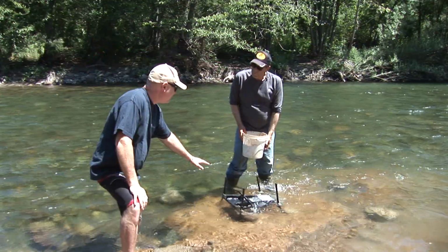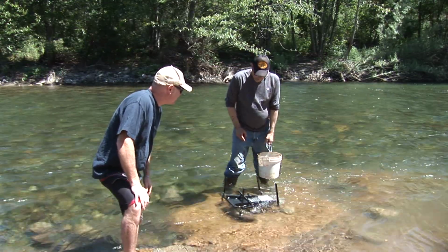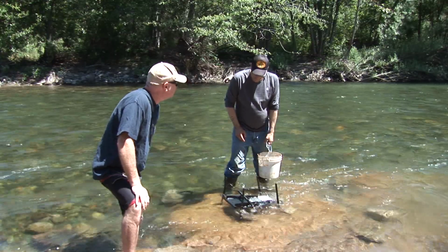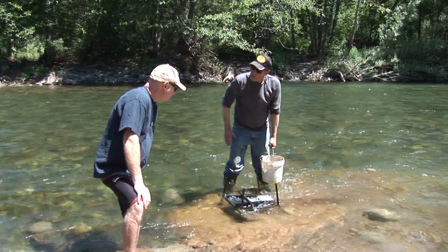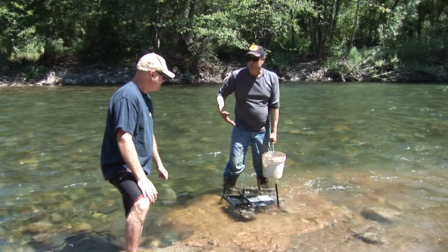So hey Kevin, you got it all set up right now? Yep. What sort of velocity do you have going through your sluice box right now to get the right action in the trap? Well, actually this is a 1 second flow, so as you drop the material, 1001, it's all in. That actually sets the perfect flow. So the flow characteristic is already built in.